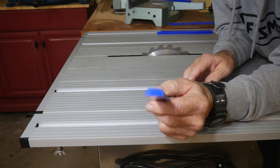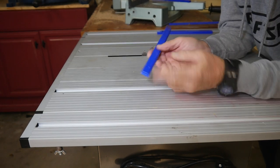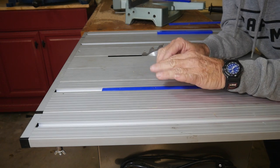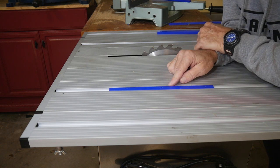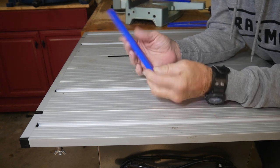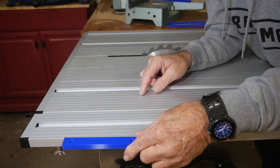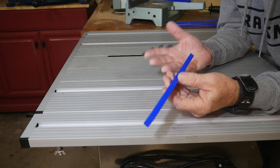The other thing I had to worry about is friction at the top. When we get the runners in and screw the board down, if the board pulls too tight and also hits the table, you're going to have a friction problem. You want a really nice balance — I drew this so it's just about half a millimeter higher. If you have lumber and want to make the runners out of wood, you can. The other option, if you don't want to do the runner-in-the-slot thing, is to run them on the outside of the saw — screw a board to each side and just slide back and forth. That'll give you pretty much the same precision as most sleds anyway.